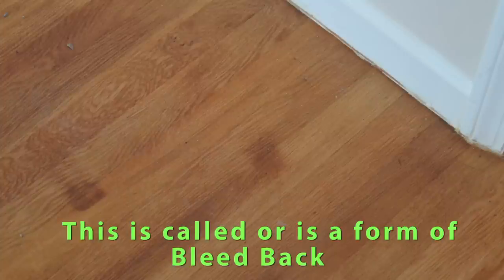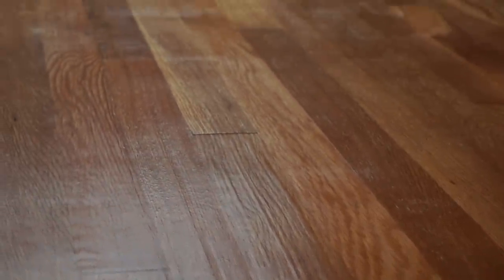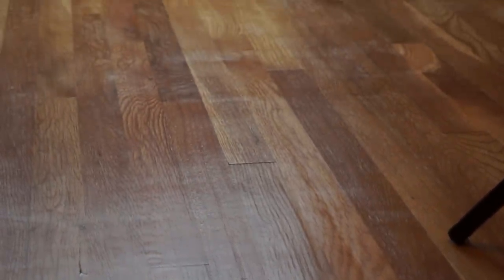The other concern is that oak flooring, when installed, is five-eighths of an inch thick. We don't know for sure how much has been sanded off, but in the low spots there's a significant amount of wood sanded down. If they come back and take it down even further, there's a good chance nobody will be able to refinish the floors because it'll be down to the nails.